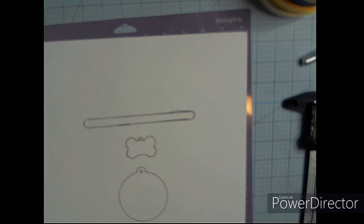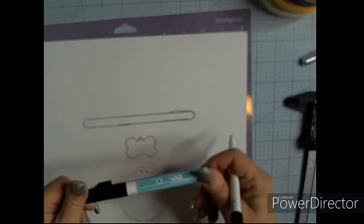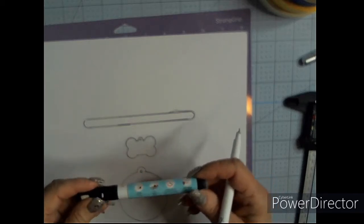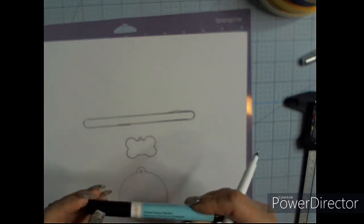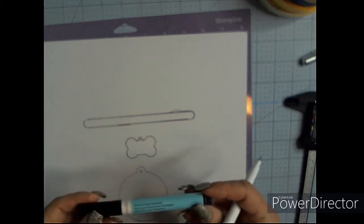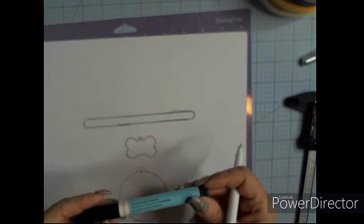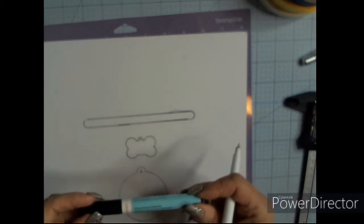Oh, and the other thing you may want to use is one of these stamp enamel markers. After you've done your engraving, you then run this water-based pen over your engraving, let it dry for 1 to 3 minutes, and then just simply wipe off the excess, and you get that antique look that's gone into the engraving that you've done.